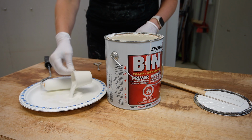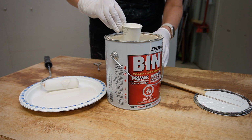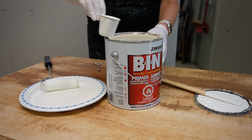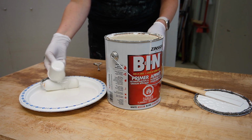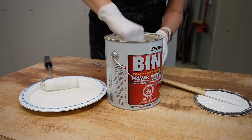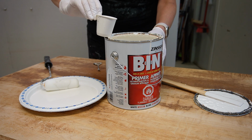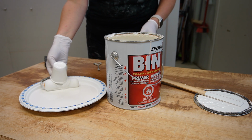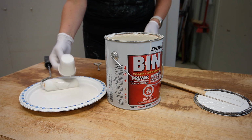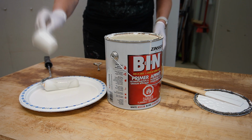So what I do is I just open it up, I give everything a really good stir because the shellac will just sit on top and it does separate. I use a little Dixie cup to put the shellac base primer onto a paper plate, and then using a high density foam roller, I go ahead and roll on my first coat. I have a full tutorial on how to use BIN shellac base primer, which I'll add in the cards above and also in the description down below.